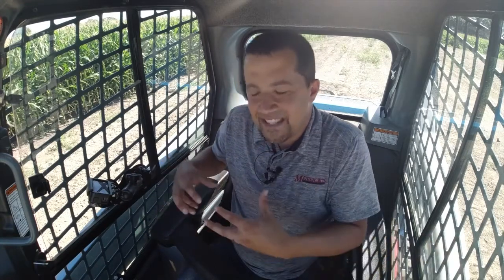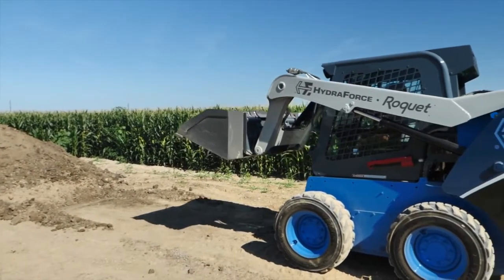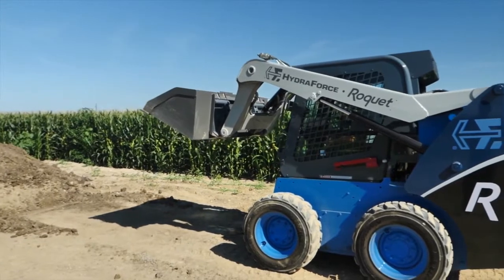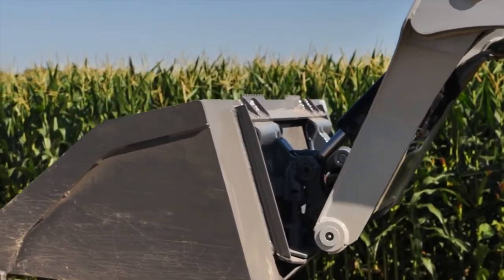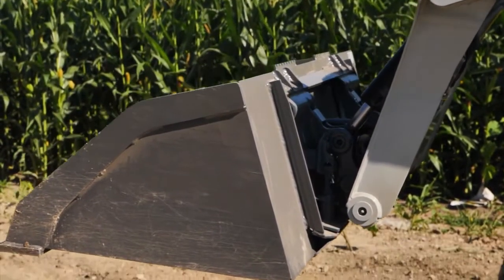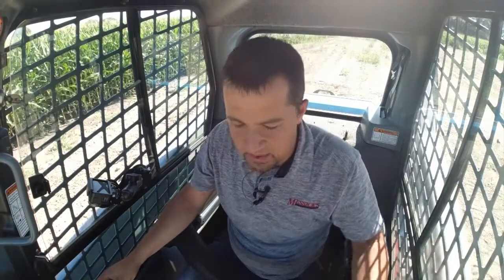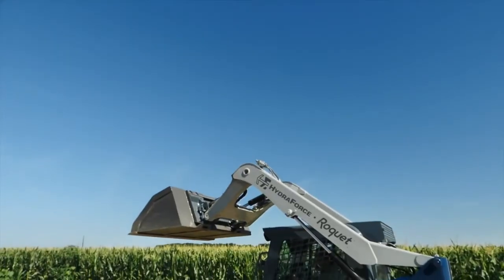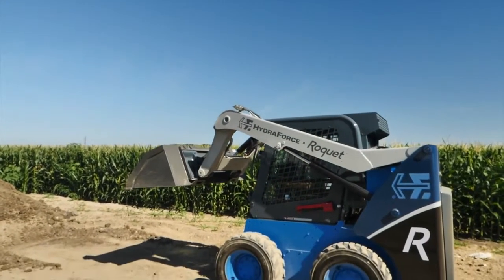When you look at the guts inside of the machine, the hydraulics that it takes in order to do that self-leveling function are fairly complicated. It adds more bulk and complexity down underneath the cab. But in this machine, simply implementing that with these position sensors allows it to be a little bit cleaner and also allows it to work in both directions. Sometimes this is a function that works going up but not coming down, depending on how the underside of the machine was plumbed. In the case of this, you can get it going in all directions.